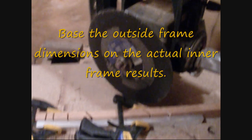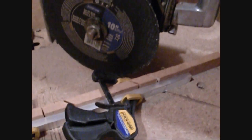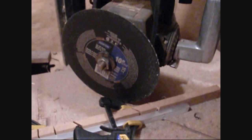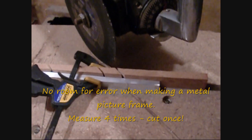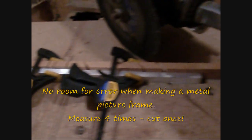What you use for this is a metal cutting bit. I happen to have a radial arm saw, but you can buy these same kind of metal cutting bits or blades for circular saws. I recommend you do it on a table saw or some kind of miter saw arrangement, and you hold your pieces in place — it goes pretty quickly.